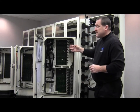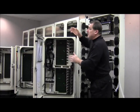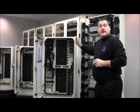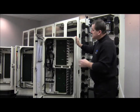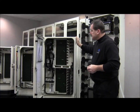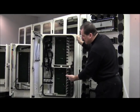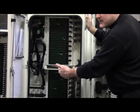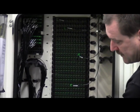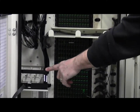The inside of the cabinet has feeder and distribution ports. For each bulkhead, there are four different feeder cassettes, which gives you 48 feeder cassettes on this one, and we've got 432 distribution points. Looking inside, we've got cable routing and cable management on top and bottom, a nice distribution tray in the back for slack management, and on the right-hand side a spot for 13 splitter modules — basically a 1x32 splitter.